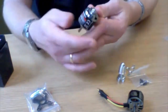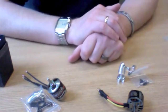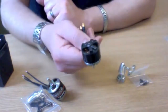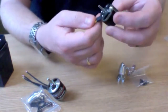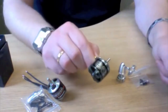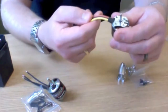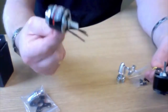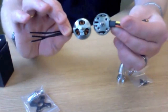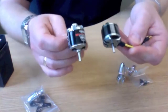When doing a bench test with a fully charged battery, after a minute or so the battery will draw less current as the voltage drops, so the motor will be safe. The voltage drop over time plus propeller unloading in flight means if you can draw 18 amps on the bench, the motor will be fine when flying. I always advise drawing the maximum on the bench test so you know you'll be safe when flying. The Park 450 claims it turns an 8x6 at 13 amps — not sure why, since they're the same KV and should be the same RPM, but it's claiming more efficiency. The NTM is 66 grams versus the Park 450 at 56.7 grams, so 10 grams difference — not huge in the overall weight of the model.